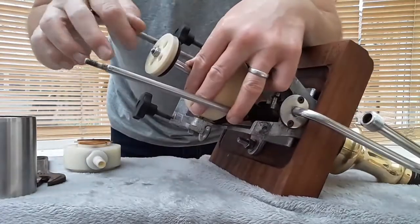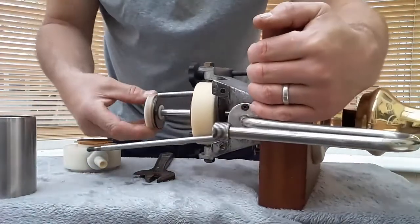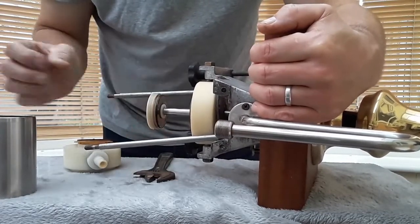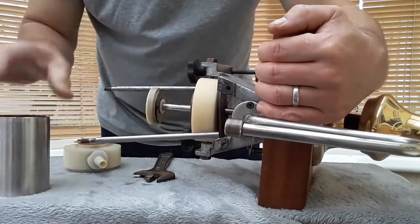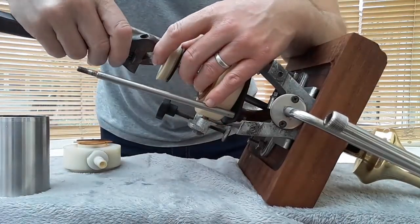So you've got a retaining nut here, so if we undo this retaining nut, now it's quite important that you remember which direction this part is. It's facing obviously upwards so that the cylinder can slide onto it. Don't get that upside down, otherwise you will have trouble pulling beer through.